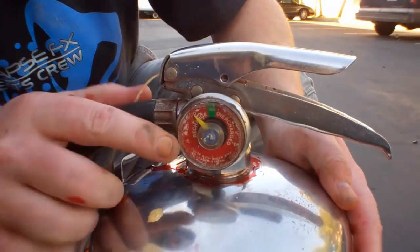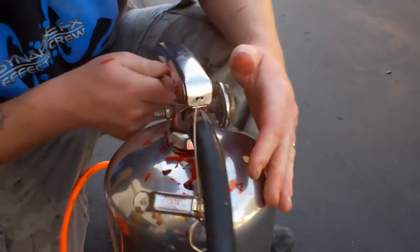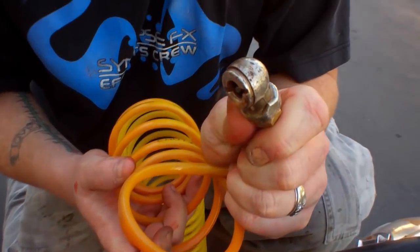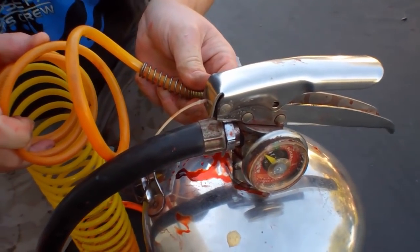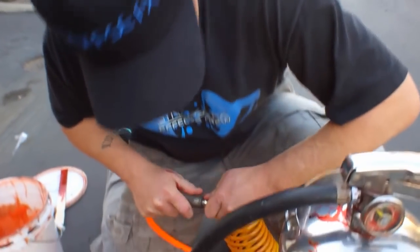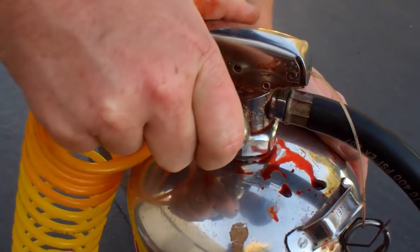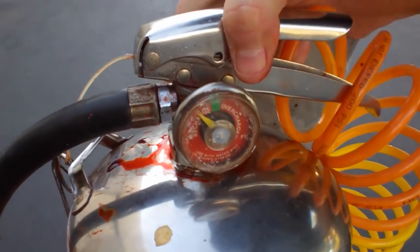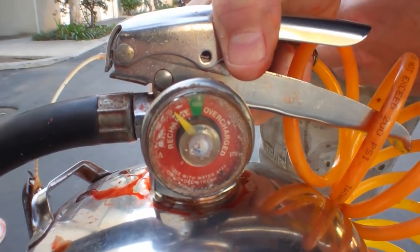You'll notice there's a gauge right here, and on the other side is where you put in your air — just like a bike tire or a car tire. We're using the same kind of nozzle you'd fill up your car with, and it will inject the air into the extinguisher. I normally like to go up to 90 PSI — the top is 100 PSI — but for this particular gag we don't need a lot of pressure, so I might just go up to 50. We're going to watch this gauge; right now it's at zero, and I'm going to go in the middle.